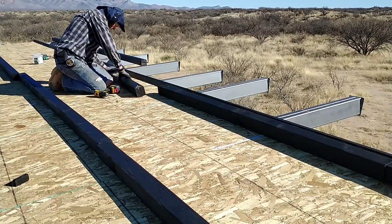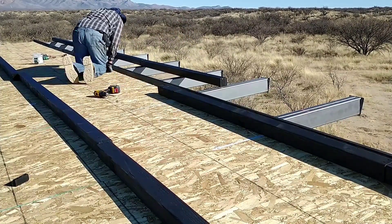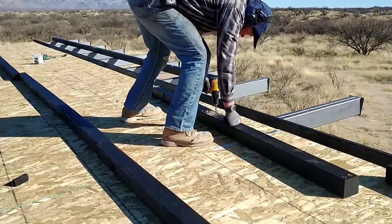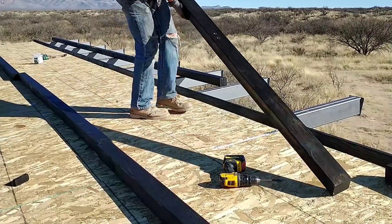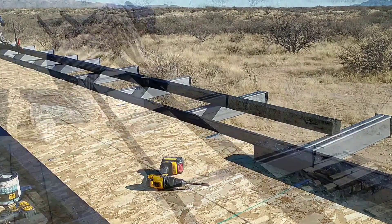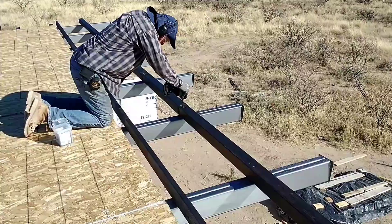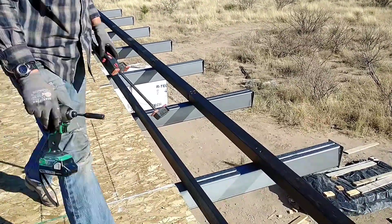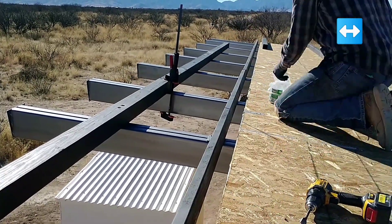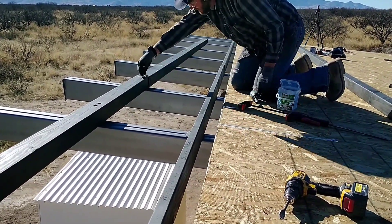Starting to place the first boards, I got them set in place along the chalk line and used a clamp on one end to hold them. When I went to put the first screws in with those big self-tappers, I realized I hadn't pre-drilled the countersink portion of the hole deep enough — I wasn't getting enough contact with the screws. So I had to go in and countersink further in all of the holes, took a little break to do that, then got back to it. The first row seems to be going on okay — the holes are lining up and my cuts seem to be the right length.